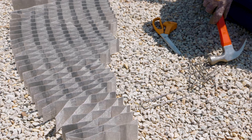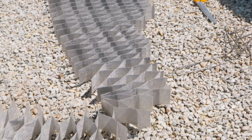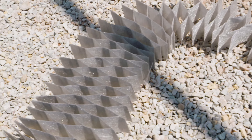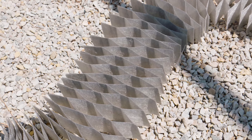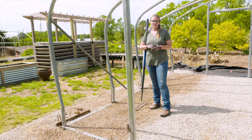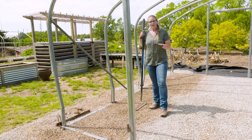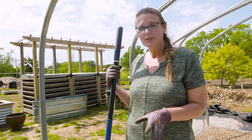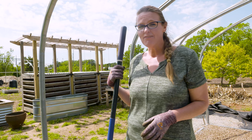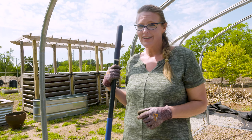If you're looking to incorporate gravel into the landscape, think about using a gravel grid stabilizer. Depending on your intention — whether you want to drive on it or just walk or set things on it — and what size of gravel you want, that will dictate what type of grid stabilizer to use. But I would highly recommend using a gravel grid stabilizer of some form, because it gives you the ease of walking through gravel without the feeling of walking through sand.